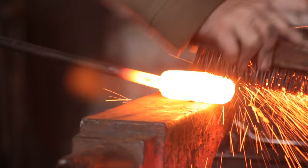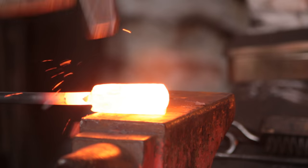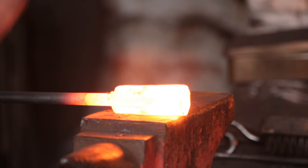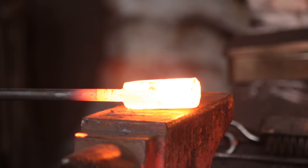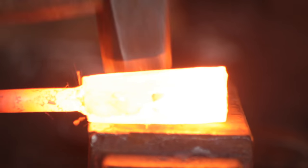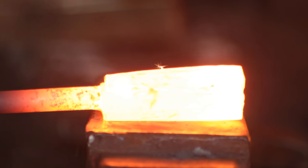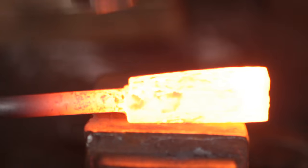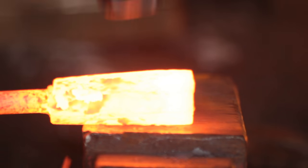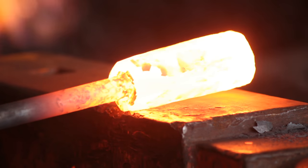I only want quite a smooth taper — it just needs to be tapered enough that it goes into the eye and then drifts it. I'm working four sides, which will bring the narrow end of the taper almost to square. As with every taper, I'm working the narrow end more than the rest of it, basically forging up towards the fat end, giving more blows to the narrow end. Once it's to the thickness I want at the narrow end, I will flatten off the corners.